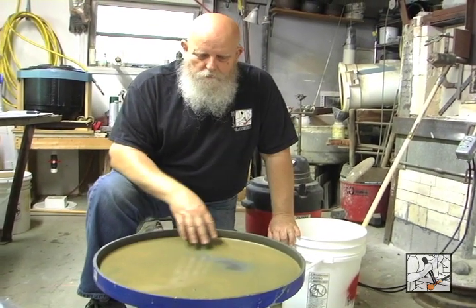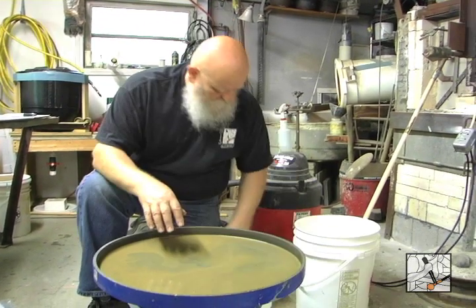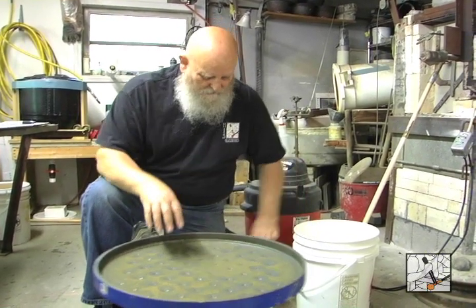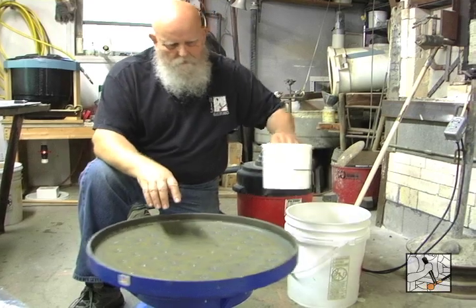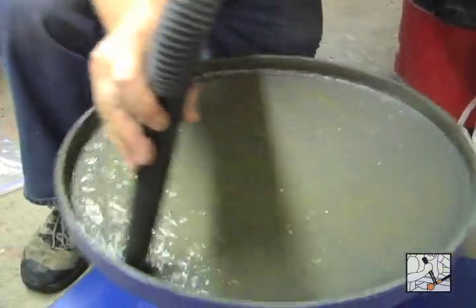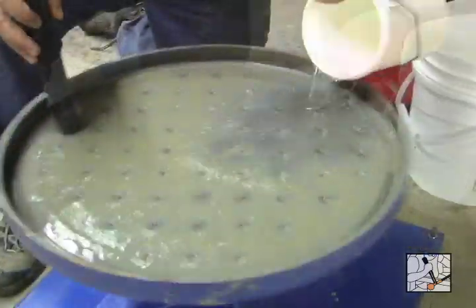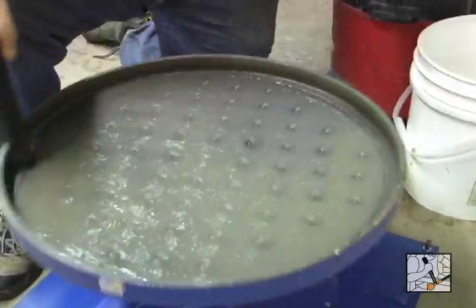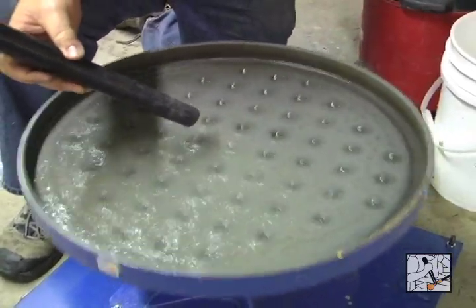Here's another alternate way to clean it, and this is going to be most valuable to you if you have a 24, 30, or even a 36 inch Reciprolap. With the machine turned on, the idea is keeping the abrasive agitated so it doesn't solidify and clump up. I've got a bucket of clean water here. I'll put in a bit more clear water. Keep rinsing it until water runs perfectly clear. Now off we go again.